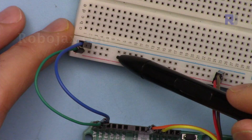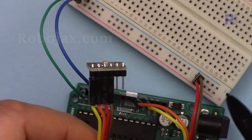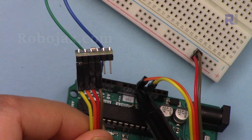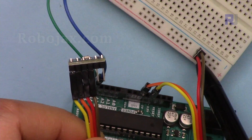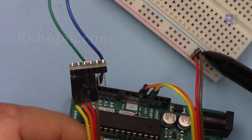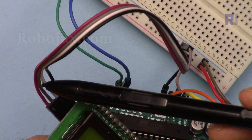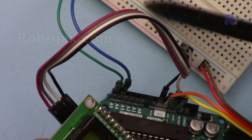So this side is SDA and this side is SCL or clock. When the sensor is at the top, the pins from the left are: VCC connected to 3.3 volts, ground in orange connected to ground, the red wire connected to clock on this side, and brown is SDA connected to the blue side. For the LCD: black is ground, white is VCC at 5 volts, and gray is SDA connected on this side.